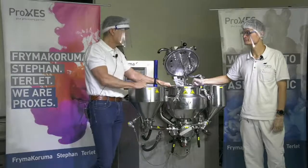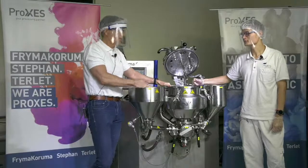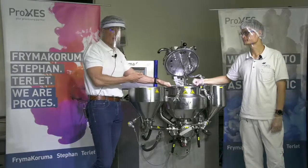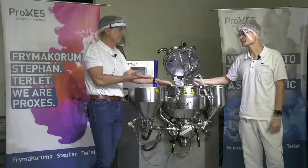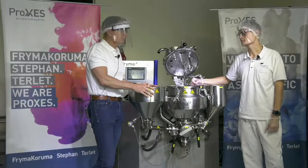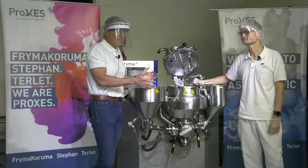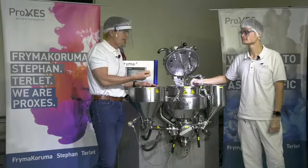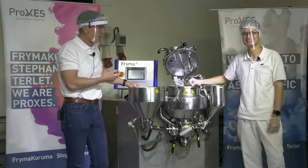Working under vacuum is a big advantage - you don't mix any air inside. This has a big advantage especially for mayonnaise shelf life. If you bring in more micro air bubbles, you bring oxygen in. Oxygen means oxidation. For this kind of high-oil recipe, we have to be extremely cautious with the process, trying to remove as much air as possible. You also get a super fine smooth texture with super fine oil droplets.